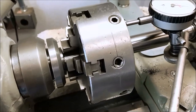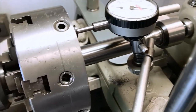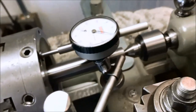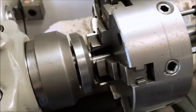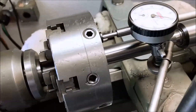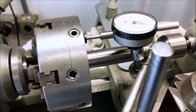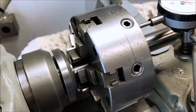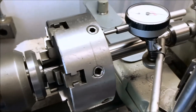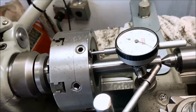Here's our setup. We've got some one-inch shafting — actually a line boring shaft that I've had but never used. We're in a center back here and over here we're in a one-inch collet. We've choked up a fair amount to minimize stick-out. The shaft runout is less than a thousandth, and this thing is pretty long — it's actually sticking out the back a little bit. We've got the chuck clamped onto our shaft, and now we're going to indicate on the back.